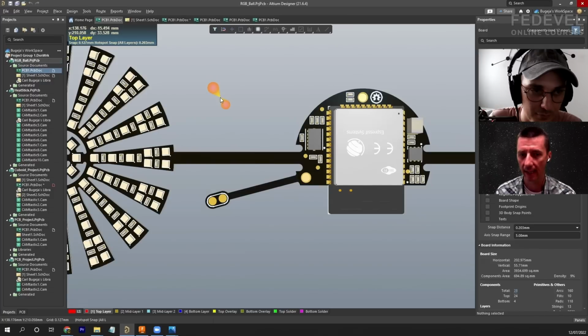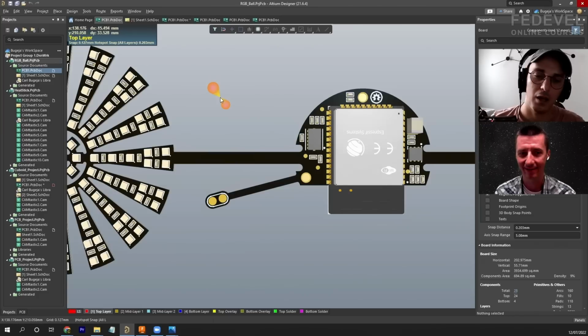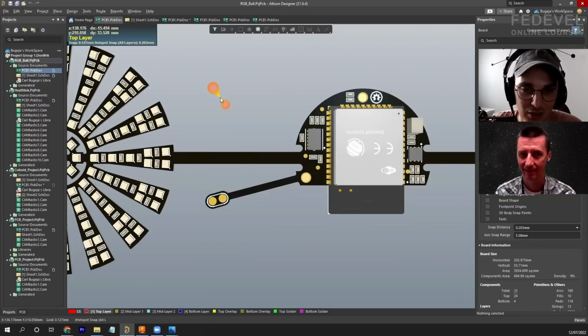Do you know how much current it drives when you use white, full bright? Since the LiPo battery was quite small, I had to reduce the brightness of the LEDs, which can also be done using software. I limited it a little so that it wouldn't damage the battery. Even if you drive 1 milliamp each, with 200 LEDs, that's 200 milliamps. I think it wasn't over 500 milliamps.